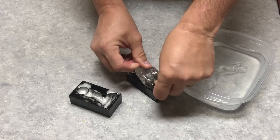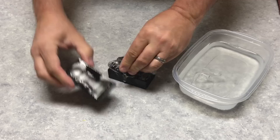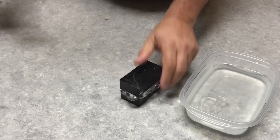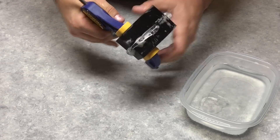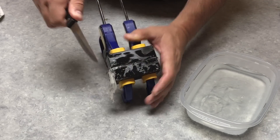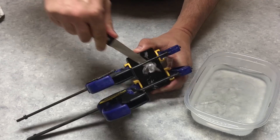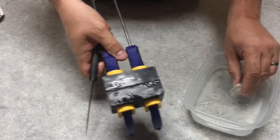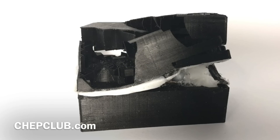I grabbed some of the Instamorph, pushed it into the mold, brought the other half and squeezed the two together. I needed just a little bit more, so I pushed it down and then used clamps to really clamp it down and get the two halves to come together. I used a knife to cut the excess off. The outside was greasy and the plastic was just slicing right off the block, which was encouraging. So I put it in the freezer to cool down and waited quite a while. The outer part was white so I thought the inside was done too — but that's where I screwed up. The inside wasn't done, and when I tried to take it apart it literally broke the mold.